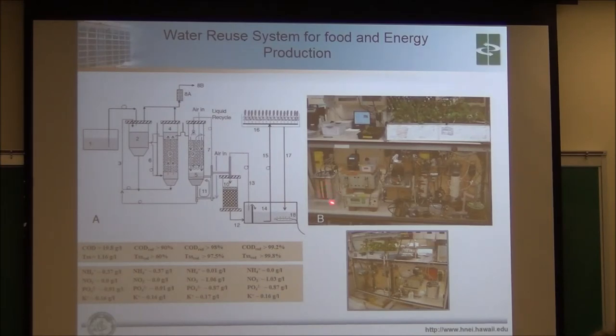We find that this water is very high in salt, specifically chloride. We're not sure whether that's because people pour salt in their food, or whether it's because the grease trap waste systems are stuck down in the ground and rotted, with saltwater intrusion leaking into the ground.